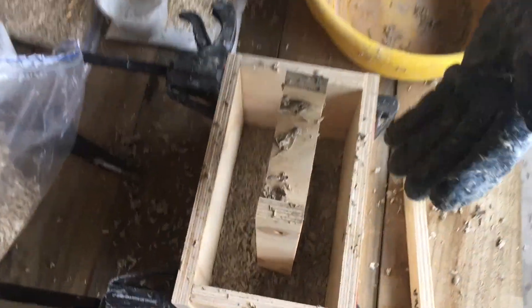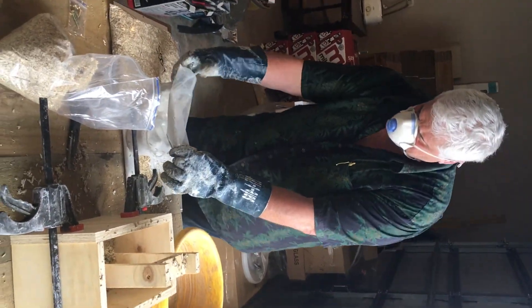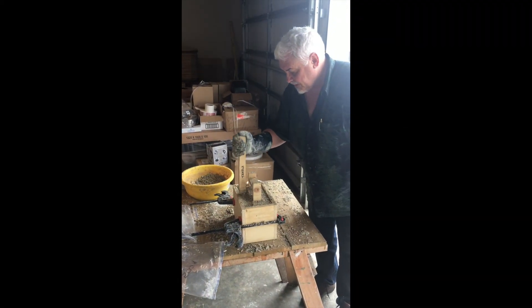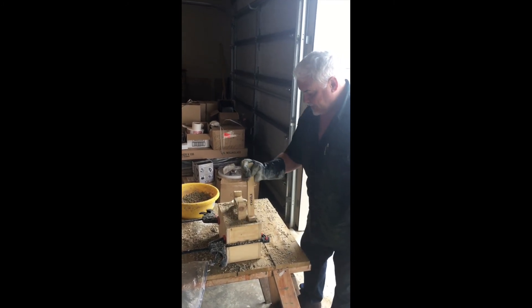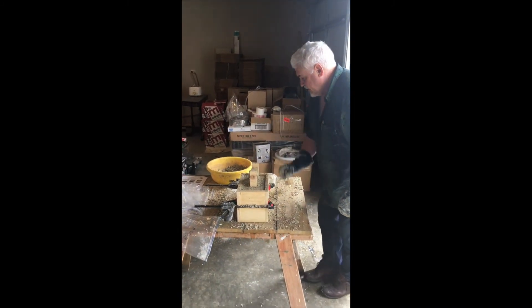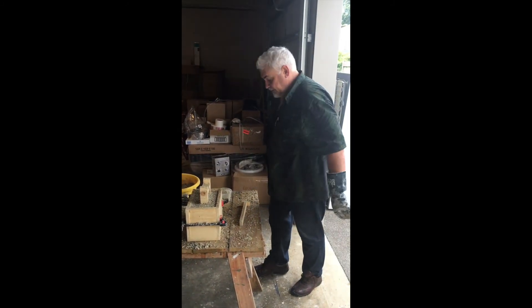Take a look inside there, Rob — you can see we're starting to fill up the form. Now for round two. We've got more binder ready. We've come to the top of our block form. Just tamp those little bits down in the middle there so it's not going to blow away on you. Haven't used all of the material — there's still a little bit of hempcrete left, but that's okay. Pretty much everything that came in the kit is used for making the block.